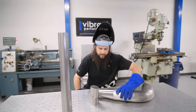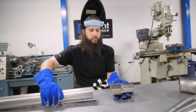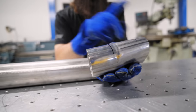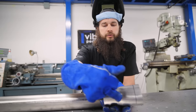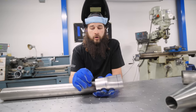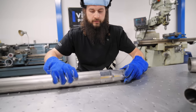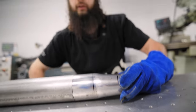Okay, so 4 nice tacks, that'll keep that good. We have a 3-inch piece of tube. We have our 3-inch round to oval. I only want to use this much section of this because it's just too long to fit where we're trying to put it. So we're gonna tack this guy to here and then it can comfortably go into the chop saw.